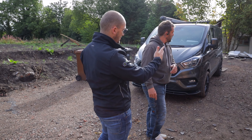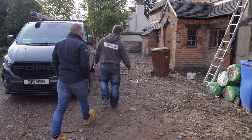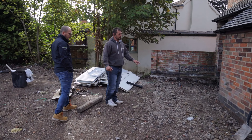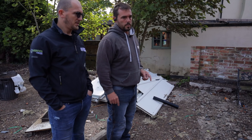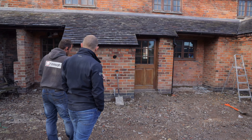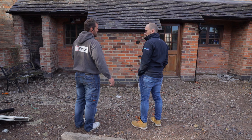So you've got three points of isolation. You're digging that channel out but you're not stopping here because we've got the cottage as well. So we'll come to a T and off the other side of the T it'll come straight down to the cottage. I think we'll be coming in through this wall here because this is where the downstairs toilet is going to be, and you've got the kitchen next door as well. We'll either pour one into the kitchen and then put a T in and bring it into here, or we'll bring it straight into the property — my personal favourite would be to swing it straight in. Just dig a trench out, assist Chris, get the connections on, and then get it all backfilled with sand over it.